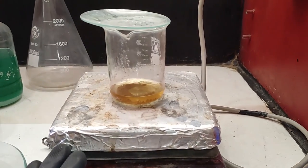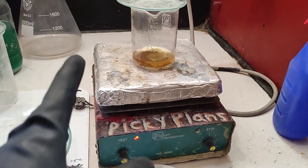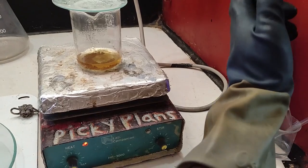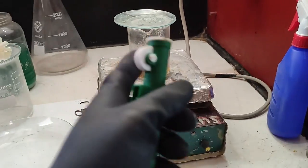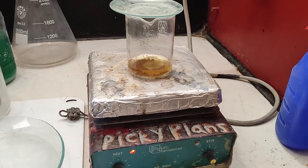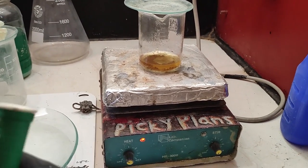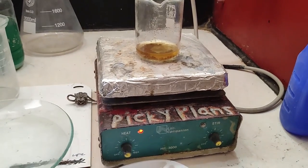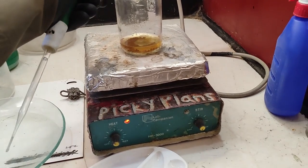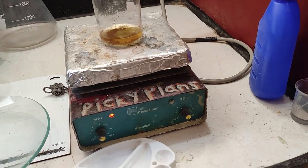As you observe here, gold powder got brown, light brown. Sometimes in this step, besides impurities in this solution, some gold dissolves in hydrochloric acid. I'm using industrial grade hydrochloric acid. These gallons of hydrochloric acid have been stored for a long time, and probably some chlorine gas is produced in them. That's why hot hydrochloric acid sometimes dissolves gold. And in our case, let's check it out.